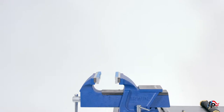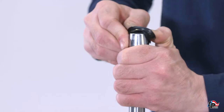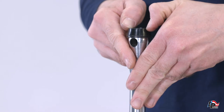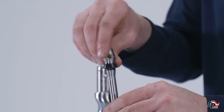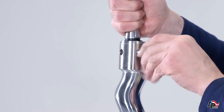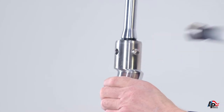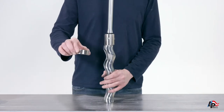Mounting the pump rotor onto the connecting rod. Put the rotor into a vise to hold it while you install the connecting rod. Install the two rubber connecting rod washers onto each end of the connecting rod. Lubricate each end of the connecting rod and the inside of the rotor head with bearing grease. Insert the end of the connecting rod into the rotor head. Push the rotor pin into the hole in the rotor head and line up with the hole in the connecting rod. Gently tap with a hammer until the pin is all the way in and flush on both ends with the rotor head. Place the rotor pin retaining band onto the head of the rotor.